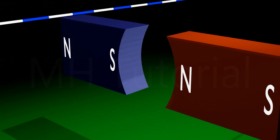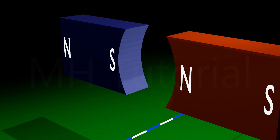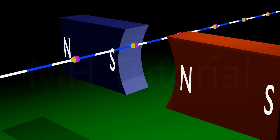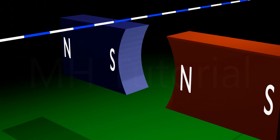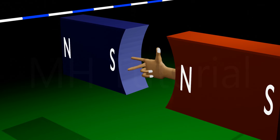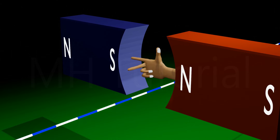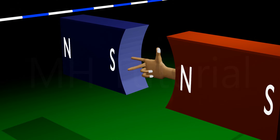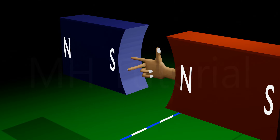In this example, the conducting wire repeatedly moves upward and then downward, causing its induced current to change direction. When the wire is moving upwards, we can compare the situation with a right hand: the index finger is aligned to the magnetic field, the thumb shows the upward motion of the wire. Thus the current should be along the middle finger — and here it is.